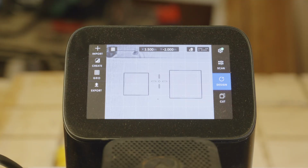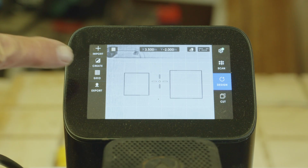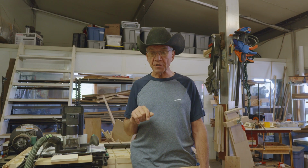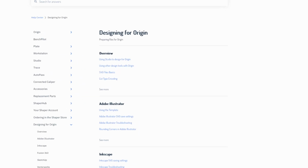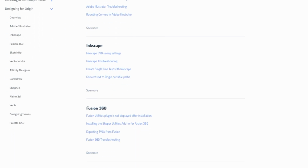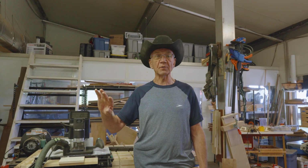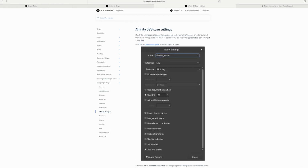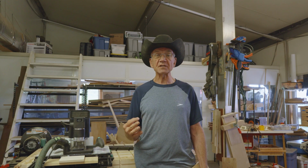For instance, I just made, this is an example, a 1 inch by 1 inch square, exported it using the correct settings, and it came out 1 inch by 1 inch, and I exported it using the default settings, and it came out about 1.25 inches by 1.25 inches. It's really easy to avoid. The Shaper Origin support pages have a page that shows the correct export settings for all of the major design software. You just have to look that up. There's a link in the description to that page. First time you export, just copy the right settings down and save it as a preset.